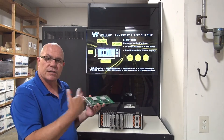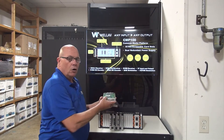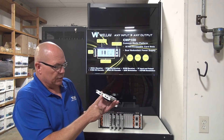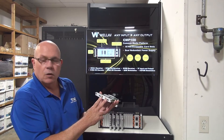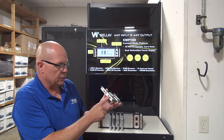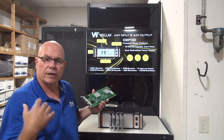The next card I'm going to show you is our HDMI card. This is an MPEG-2 only card. This will allow us to do HDMI in with closed captions — we have our CVBS inputs, or CC inputs. It embeds the captions so that we can then encode to MPEG-2 and send this out in QAM or IP.